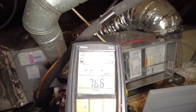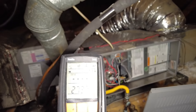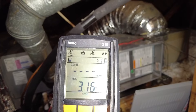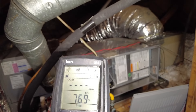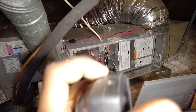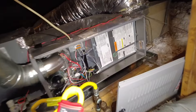Let's take a look at our readings. O2 is 15 — that's very high. CO is 14. Looking at gas pressure and excess air — wow, 273%. That's super high. So we might need to turn that gas pressure up. Let's keep that running, make sure all this is sealed.